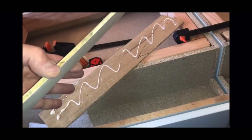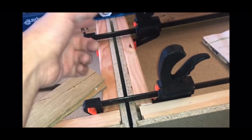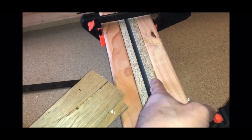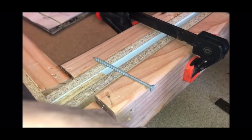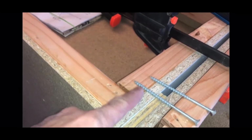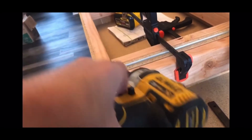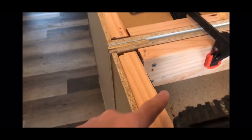2 pieces of 1/4 inch, put those together, and I'm gonna slide them in here so I could put these together and it could have the support that's needed, because if you try to screw this in right now, this will buckle. Gotta have it solid. Drill 2 holes here and here, going through this to the Luan. Make sure that your screw is gonna reach the other end so it could actually get that support needed. Try to have an impact drill, because getting those long screws through there is a little difficult unless you pre-drill it all the way through.